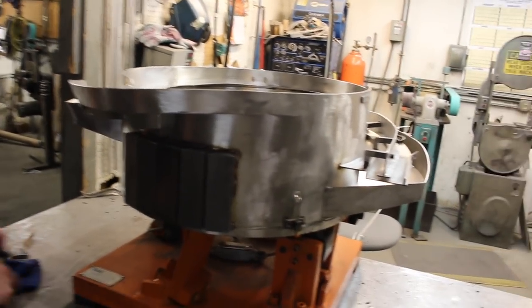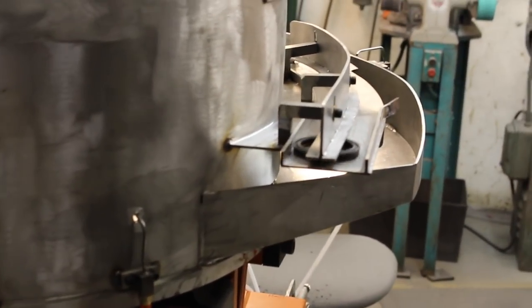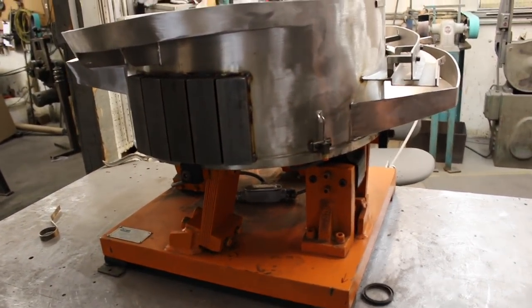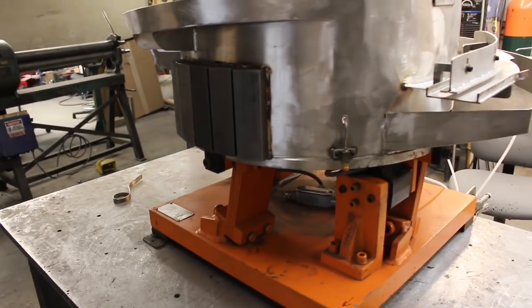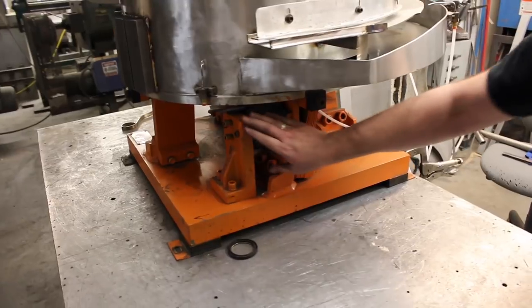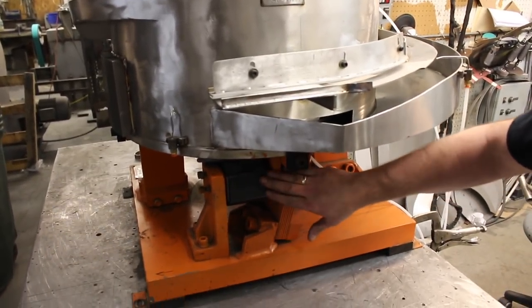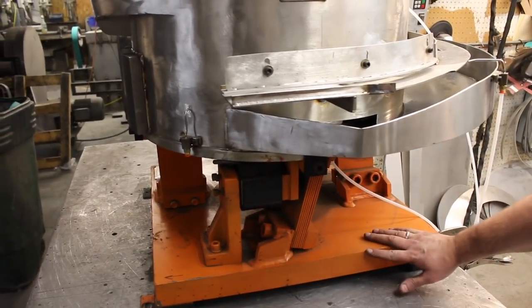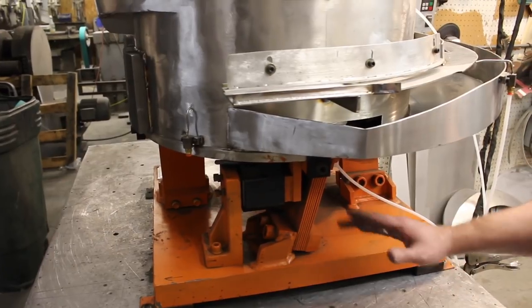You're looking for about the right sound — you don't want any hammering. Basically it's like tuning in back here on this coil. This coil wasn't running as close — we've got a good gap. If we were really too close, you'd hear a hammering sound, and that's what you want to avoid. That coil's running nice and cold. It's got a lot of power. That's what you're looking for in the unit.